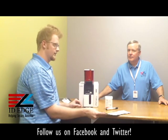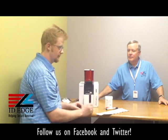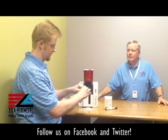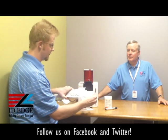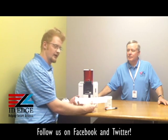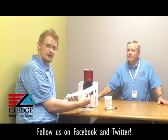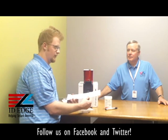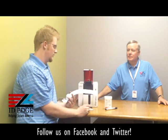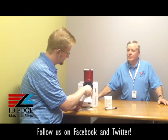To do a full advanced cleaning, you're going to want to just double click the power button there. You'll hear the roller spin a little bit. Then we'll go ahead and tear open this alcohol saturated card. This is pre-soaked with rubbing alcohol, so just make sure when you're ready to clean, that's when you open it. If you open it too soon, all the alcohol will evaporate and you'll have a dry card and it won't clean. So just go ahead and insert that.